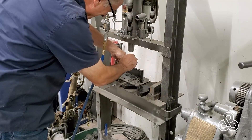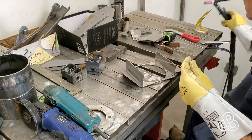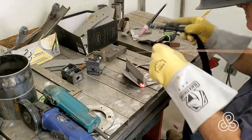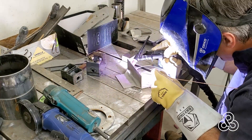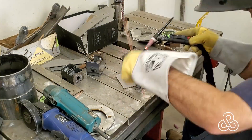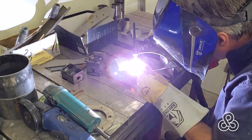Now I'm going to move on to the main box structure of this upright, made out of a couple of larger pieces of plate cut with a big six inch hole in the middle, because the main structure of this thing is a piece of quarter inch by six inch pipe. It's going to be flanked on both sides by a couple of pieces of plate with these big holes in it. To hold that spacing on those, I've got a couple of perpendicular plates with some slots and tabs. I'm going to weld the first side up, tack weld it on the inside, and then fill in our slots and tabs.